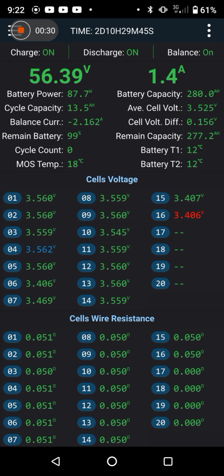Now that they're into the steep part of the charge curve. So very, very good. Certainly is the quickest and easiest and safest and laziest way of top balancing a pack, is just find the Goldilocks zone and keep wandering up, poking the buttons, disappearing, wandering up, poking some buttons, disappearing.